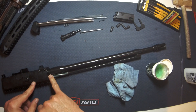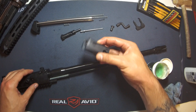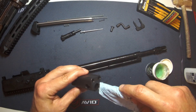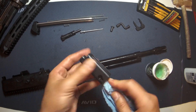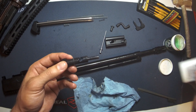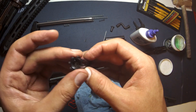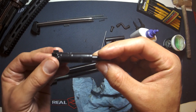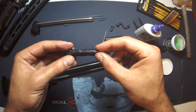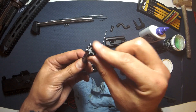There have been some reports of barrels coming loose after sessions of firing - I'm going to keep an eye on that. Now we've got to reassemble the bolt and bolt carrier. It's been nicely degreased, which is what we wanted. I'm going to take the small end of this brush, wrap it in the rag, and dig around inside of the bolt carrier to make sure we get the grease out. It's pretty dirty inside. For the working parts I'm not going to use this thick tacky grease - I'm going to use the ALG GoJuice because I think it works a little bit better. You'll see some of the finish is wearing off already, just from the little bit of racking I've done with it - that shows where the friction areas are. So we're going to apply grease wherever the finish is wearing off, because that's where friction is happening, and anywhere else friction is going to happen. Around the tail end for the spring, around here just to keep it lubricated. I also want to get onto the locking lugs - put a dollop there and spread it around with the fingers because this is going to be a high friction area.